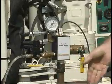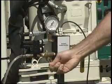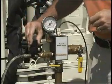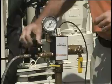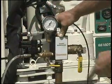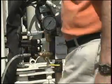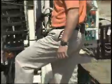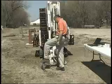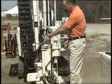It's stable, so we'll close the valve. This valve I'm going to close before I start pumping and pressurizing. And the pressure regulator — I'm going to close that. Next, I'm going to pump a few psi of air into the tubing with our foot pump. This is really about the hardest part of this job. So I've got about 30 or so psi of air in the tube system.